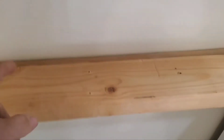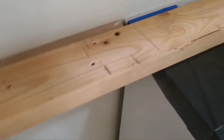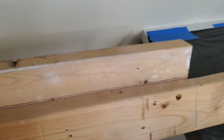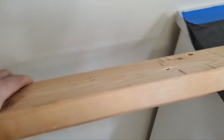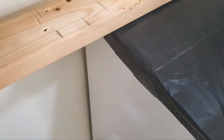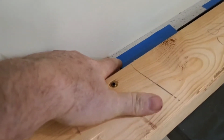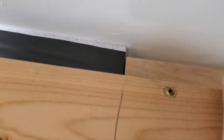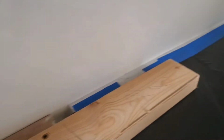And then, of course, everybody knows to screw a 2x4 into the wall to hold your line. But I heard of this. Screw a 2x4 to the bottom of another one, and then set it in there. Of course, you can see perfect offset. I cut it a little short because the tiles are that long. So, yeah, that'll carry the tile flushly over to the other countertop.